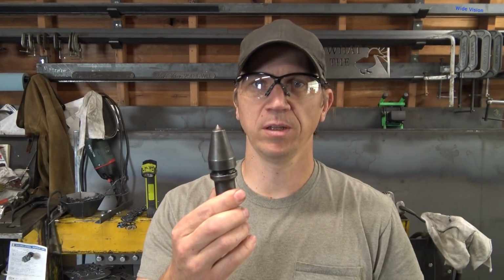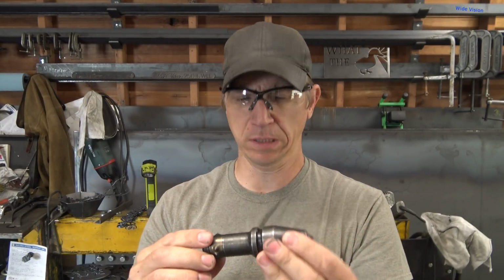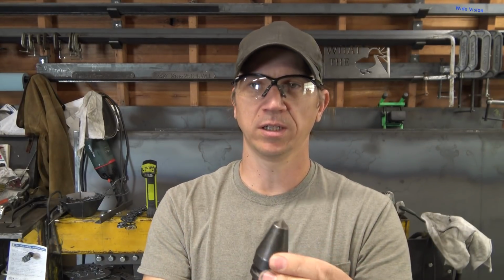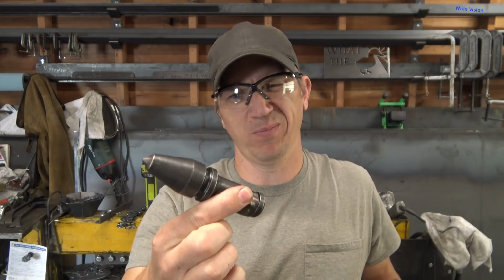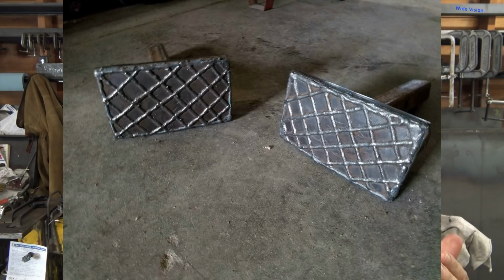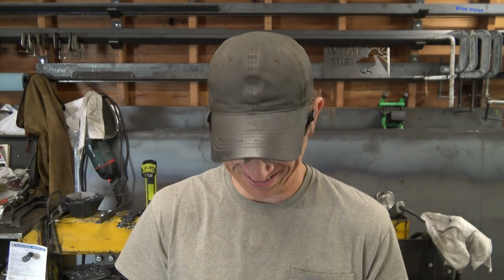So the customer brought me the bullet teeth, I guess they're called bullet teeth, to make the reamers out of. These are the same teeth that are on the front leading edge of that auger. He decided to use these. He likes them a lot better because he can just replace these. I think they're like 13 bucks a piece. Whereas with the old paddle style reamers that he had set up, he was having me hard face them. Forgot how many hours it ended up taking to hard face all that. Yeah, he can just replace these whenever he wants, is the whole point of this.